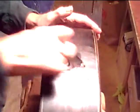I kind of take a different part of the pad and clean off the slush. If you leave too much slurry, you're going to have a lot of sanding. The people who are really expert at this, which I'm not, are usually able to fill without having to sand at all afterwards. After that, they just start French polishing. But I've found I always have to sand a bit. I always have a little bit of patchiness where I've left some pumice. I'd rather do that than try to clean it. A lot of the time when I'm trying to get it too clean, I'm just pulling it back out of the pores.